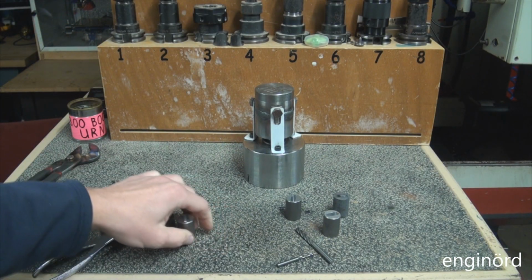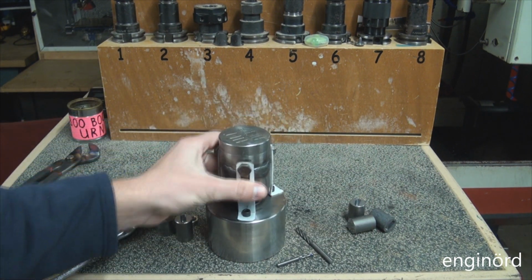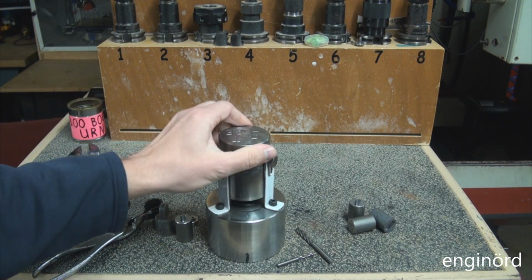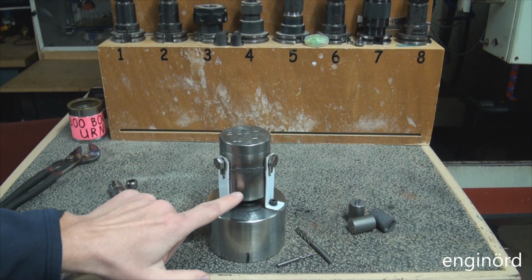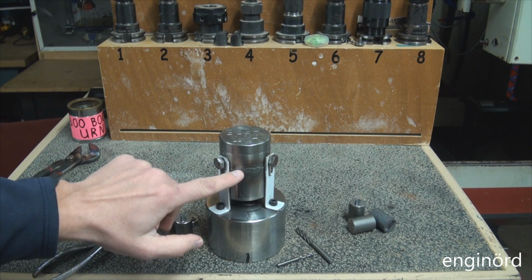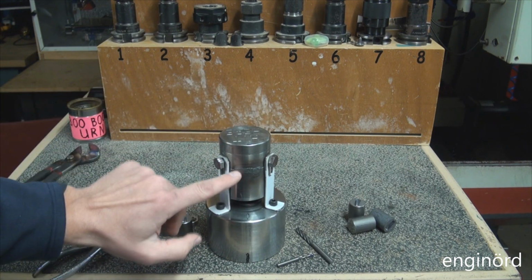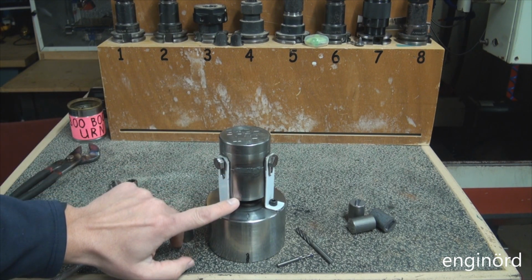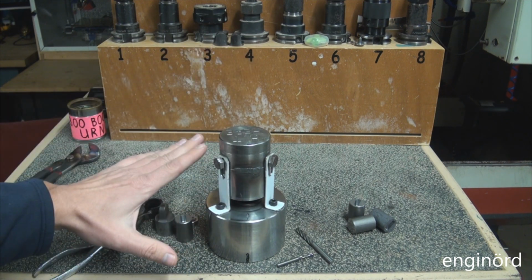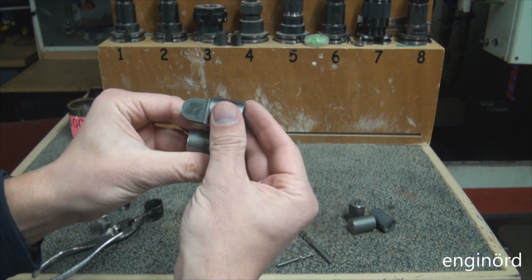The next thing I did is I altered the upper tool. So this is the upper tool, and I did some tests, and this ring here acts as a limiter, so when I hit this, the whole thing goes down, and this piece of tube hits the bottom here, and it limits the travel so that the tool will not go beyond its point.